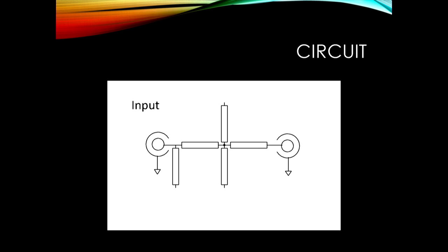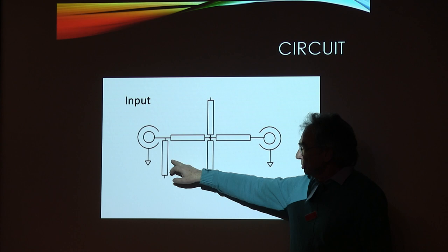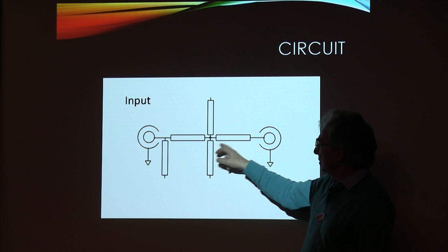In practice, this one is a quarter wave on 2.6 GHz, that's a quarter wave on 3.9 GHz, that's a quarter wave on 5.2 GHz, and that's a quarter wave on 23cm. And this bit is the reflectometer section out to the outside world.